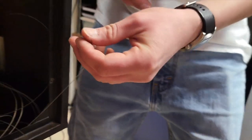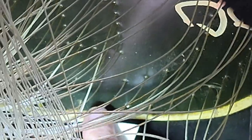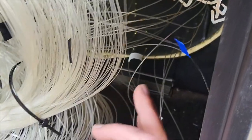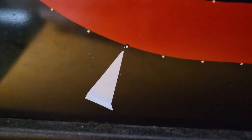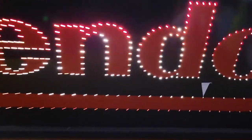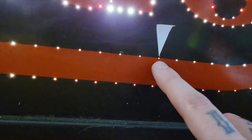That's a pretty clean cut. Going to stick it right through the other side, put some adhesive, and pull the fiber through — it's not glued in place yet, but we're going to turn it on and make sure it illuminates properly before we go any further. Powered it on — looks like it's illuminating properly. It's the correct fiber, it's in sequence, that's what matters most. It's not weak. This one over here that we repaired is illuminating a bit weak and we believe it's because there are multiple couplings inside, so we're going to drill that one out and replace the entire fiber strand as well.